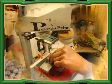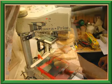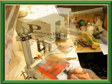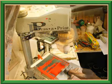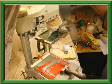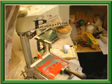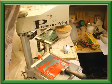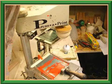Go at a slow, gentle, deliberate pace. Move the machine with a light touch. We ink and pick up the red side, move over and print. Then we swing over to pick up the black side of the image. If there's enough thinner in the ink mix, the pad releases the red fully and it can immediately go over and pick up the black.